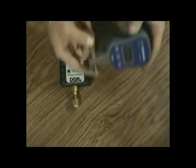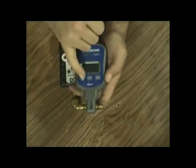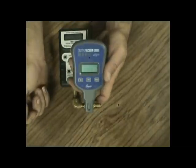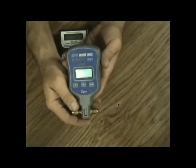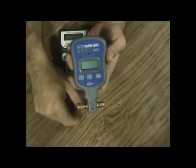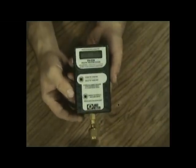The Supco VG64 has a flow-through design with an auxiliary port and a vacuum port, so if you're not pulling through you cap one and pull from the other. I never noticed any difference in performance between the two ports, but it is what it is. Pretty good resolution, pretty accurate, pretty rugged — not a bad little micron gauge at all. But again, not field calibratable, no temperature display, and it may or may not be temperature compensated.